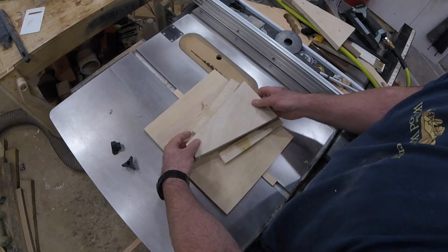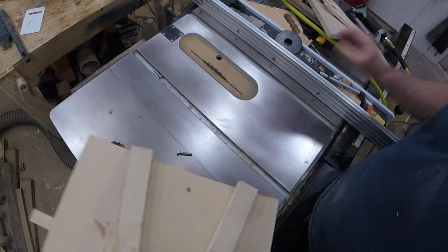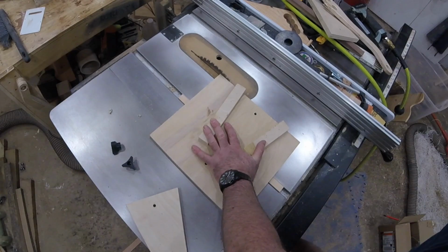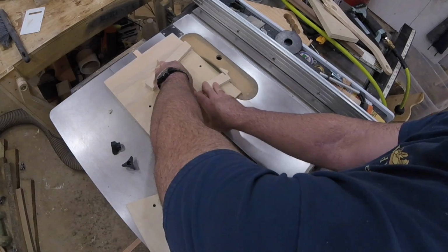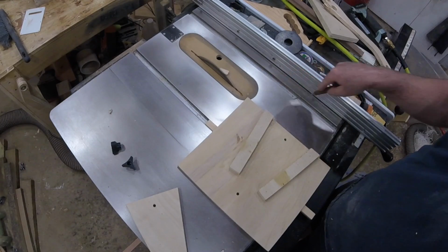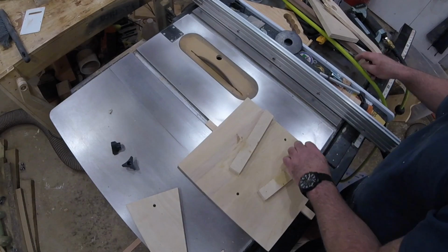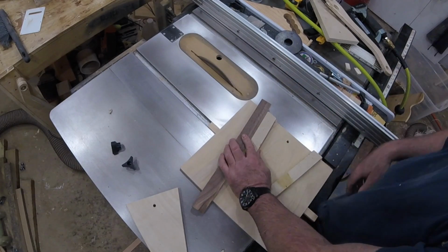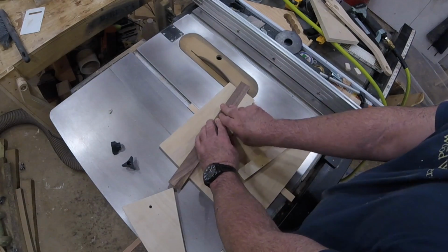I guess the downside is that this sled is only good to cut one segment angle. But this sled is so easy to make, literally 10 minutes or less. I can make 3 different sleds for the angles I use, and they're small enough that 3 hardly take up more space than 1. Another advantage to making this sled is that it requires only a table saw, where the original adjustable wedgie sled takes a table saw, a router, circle jigs, and hardware for use on the sled itself. And once that adjustable wedgie sled is set up, I'd always worry that something is moved, and that would have the potential to waste a lot of material.